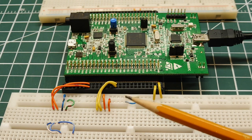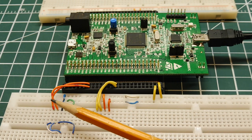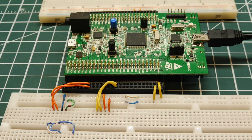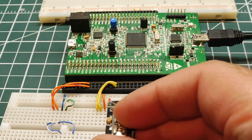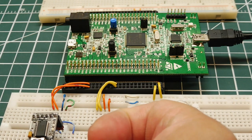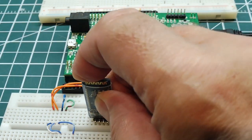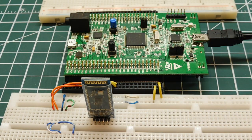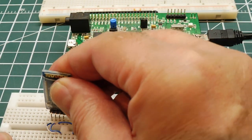I've also brought out two USARTs — two RS232 ports: USART1 and USART3. We can gain access to the serial port through a module like this USB-to-serial FTDI, which I could plug in to access USART1 or USART3. I could also go wirelessly by plugging in an HC-06 Bluetooth module and gain wireless access through Bluetooth into USART1 or USART3.